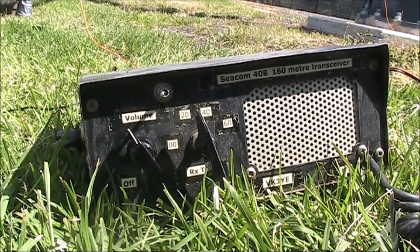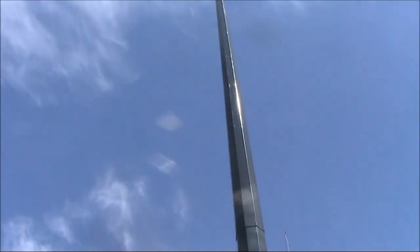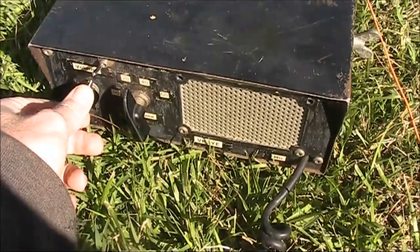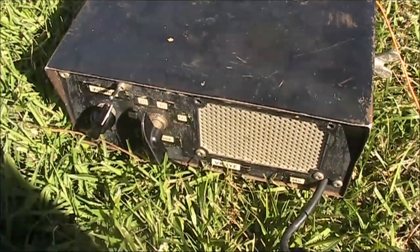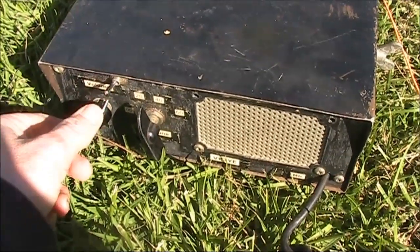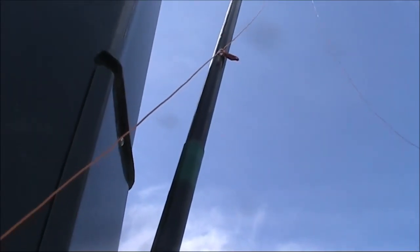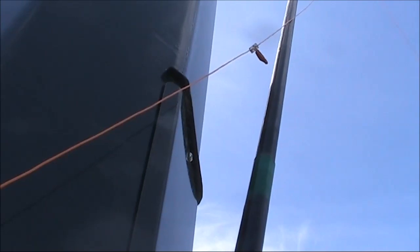An attempt to load up a tall light pole. I'm using a loop made of 20 metres of insulated wire. About a third of that is running parallel to the tall light pole, with it being supported with a squid pole. It's a makeshift arrangement, only decided on the spur of the moment, so it's difficult to keep the wire near the light pole, which would probably be desirable for tight coupling.